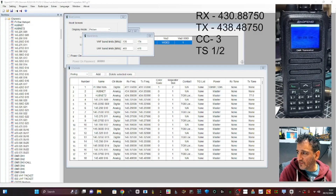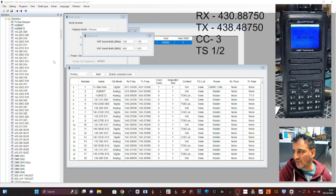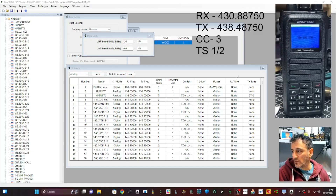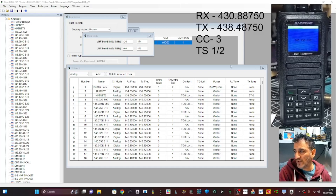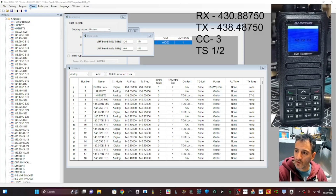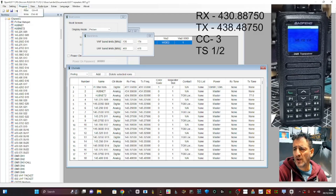What we're going to do is add our repeater GB7FI — you can see I've just written the frequencies there to remind myself. Connect your radio; you do need a special cable for the DM-1701, they're not expensive. My advice is get one when you order the radio — about six pounds in the UK. Connect up, download the software — I'll put the link in the description — and it installs the drivers you need. Once connected via the twin pins, you can go to Program and Read.